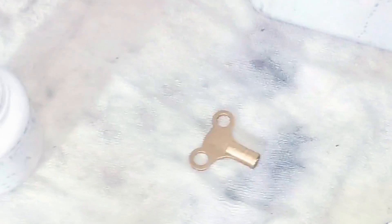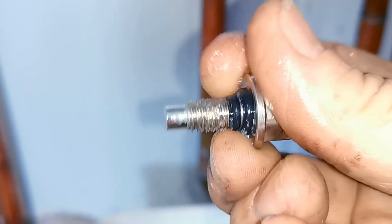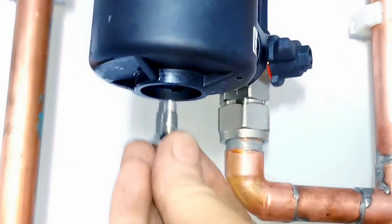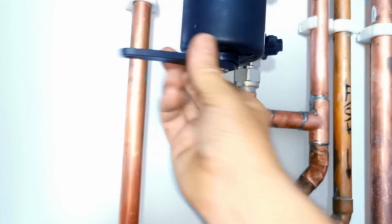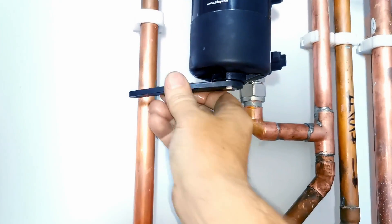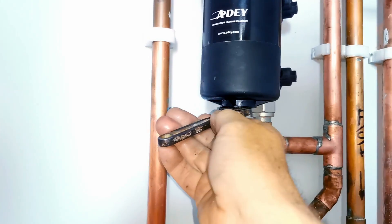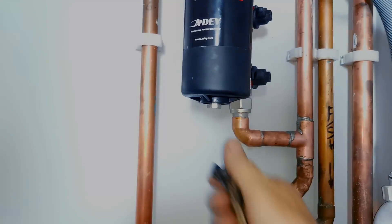Don't forget to put your plug back in the bottom. You can see there are a couple of o-rings on it — get some silicone grease and make sure those o-rings are nicely greased up. This will help it come out easily in the future, keeps them well lubricated, and helps prevent any leaks. Pop it back in the hole at the bottom, do it up hand tight until it stops, then get the little spanner and nip it up further. You could also use the adjustable spanner. Just nip it up — it's not something you do really tight, just nip it and that's it.